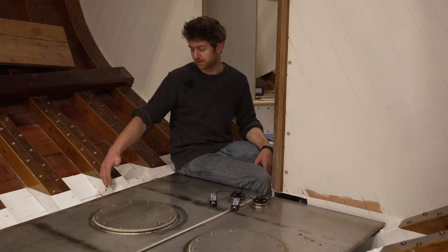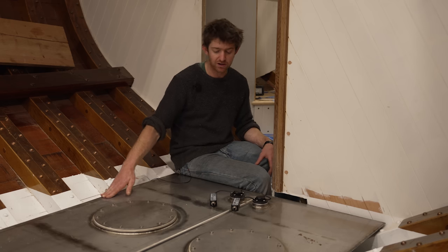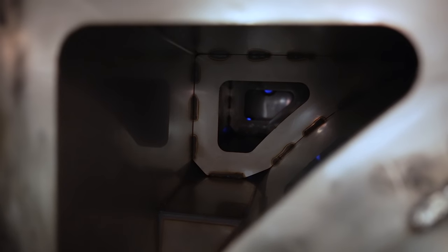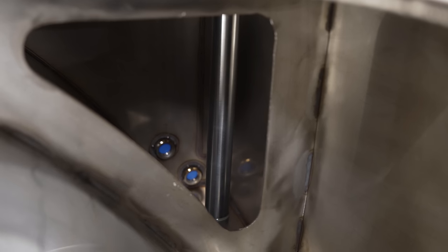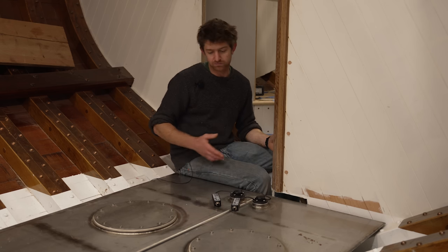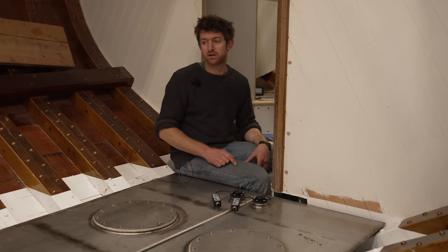Now these tanks are actually load bearing, they're fastened really well into the frames, they're going to have a couple of little blocks underneath them fore and aft, and then the sole boards will sit directly on the tanks on thin bearers which will run on top of the baffles inside the tanks. There's three baffles inside each tank, there's two inspection hatches on each tank, there's an ultrasonic sending unit on each tank which tells you how much water is in the tanks, and again these are fresh water tanks, so this is for drinking water, for washing, showering water, etc., and they'll be fed by a water maker as well as from the dock, and then the outlets are on this end at the lowest point, and there's various fill and other inlets and outlets for various things.